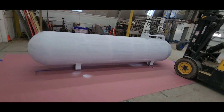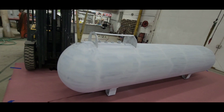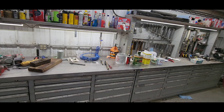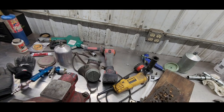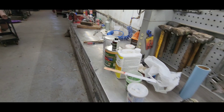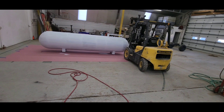We got the tank painted. It's not super pretty. That gun kind of didn't work much better — supposedly high volume, low pressure but they appeared to be low volume, low pressure. Before we do any color coats, I may not have thinned my paint enough and I didn't strain it — that's probably part of it. Before we put any color through them, we're going to tear both guns apart, make sure everything's cleaned up. I also found a siphon-style gun that was super dusty — we may look at that one. Get them cleaned up, pull the needles out, check for dried paint, so the color coat goes on smoother, faster, and cleaner.